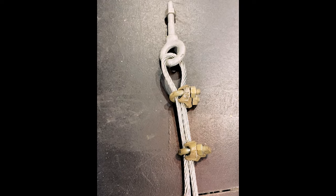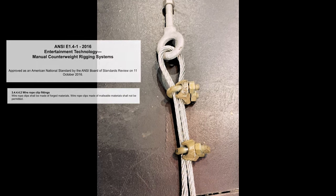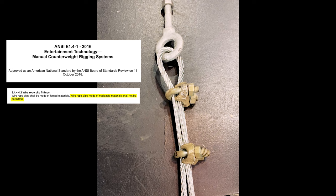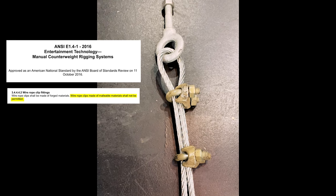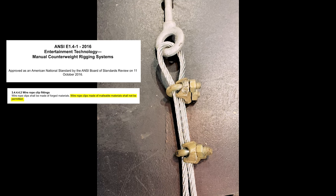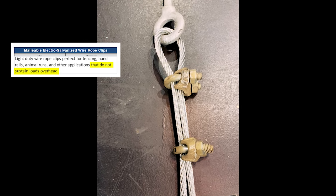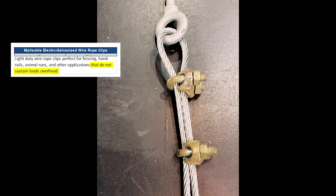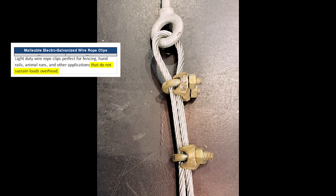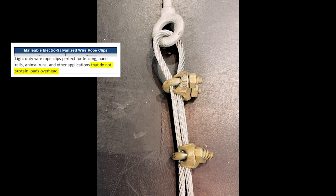Malleable clips require three at each point, not two. Malleable clips are not considered safe for overhead rigging — in fact, they are explicitly prohibited in counterweight fly systems by ANSI regulations. This installation was a dead-hung system, so the counterweight fly system ANSI rule probably doesn't apply, but all manufacturers of malleable clips state they are not for critical installations. We consider any overhead load — dead hung or counterweight fly system — in a theater, showroom, or any theatrical entertainment context to be a critical installation.